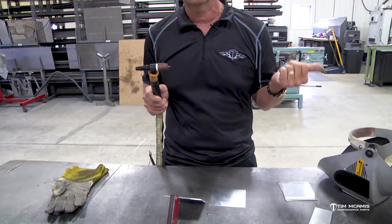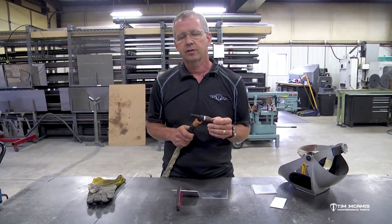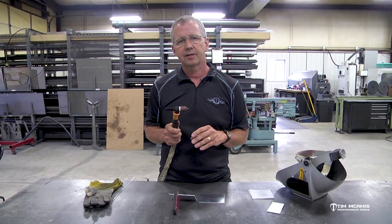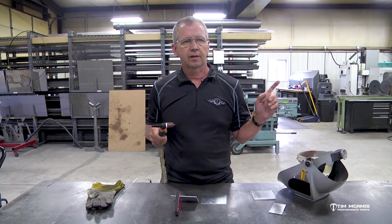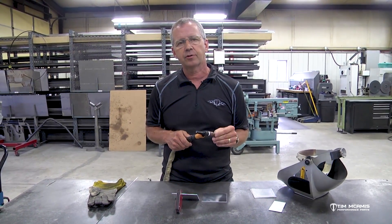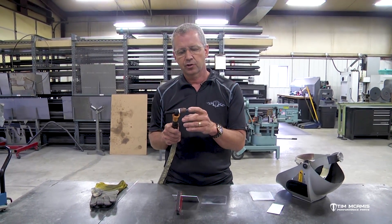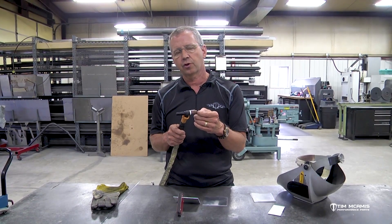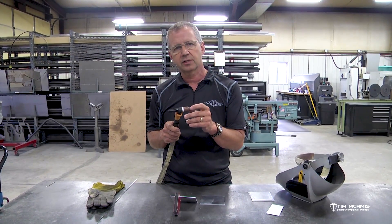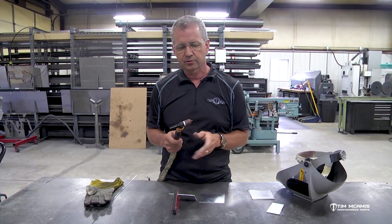We're going to use a 5356 rod welding on 3003 aluminum, and we're also going to use our hybrid tungsten. In the previous weld videos I was using a 2% thoriated - that's the red stripe tungsten. This is a hybrid tungsten which has a purple stripe and is much more stable for the Dynasty. If I was welding aluminum with the Syncrowave I would use a pure tungsten, which is a green stripe. The sharpening of the tungsten is similar to the other metals, but when we weld aluminum we're going to get a little ball on the end because of the frequency and the AC, which makes the weld nicer and cleaner.